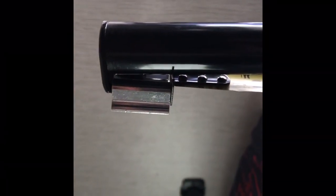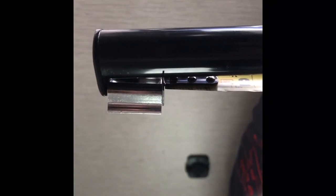I have the short bracket on there with the measuring tape butted up against the bottom, running it down to where I want the bottom bracket to go — right where most of the wood support is for the top bunk. That looks like approximately 14 and a half inches, so in order to make the bottom of that bracket sit right there, I have to shave off 14 and a half inches off of this ladder.